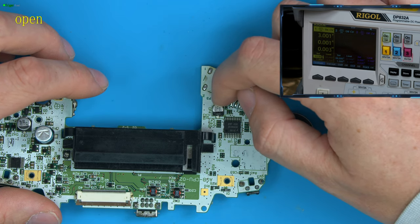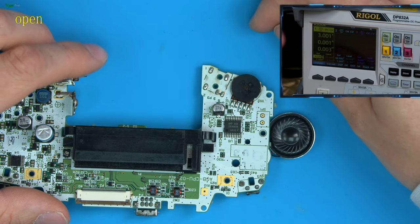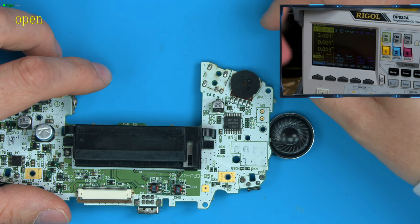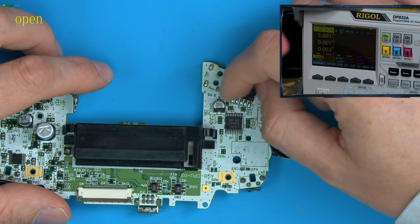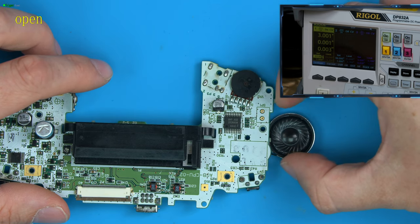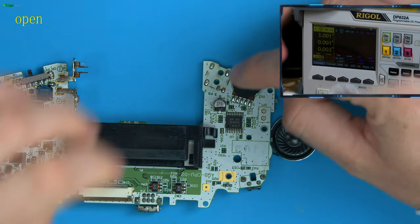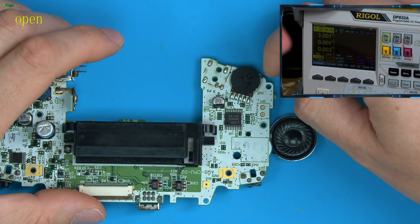and the headphone socket should be grounding one of its pads when there is no headphone inserted. And when you insert a headphone, it removes the ground and floats the pad. So at the minute, with no headphone jack connected, it will be floating the pad that needs to be grounded and causing the audio to turn off on the speaker, but presumably work through the headphone jack. So the fix for this would be to solder the correct pad to ground.